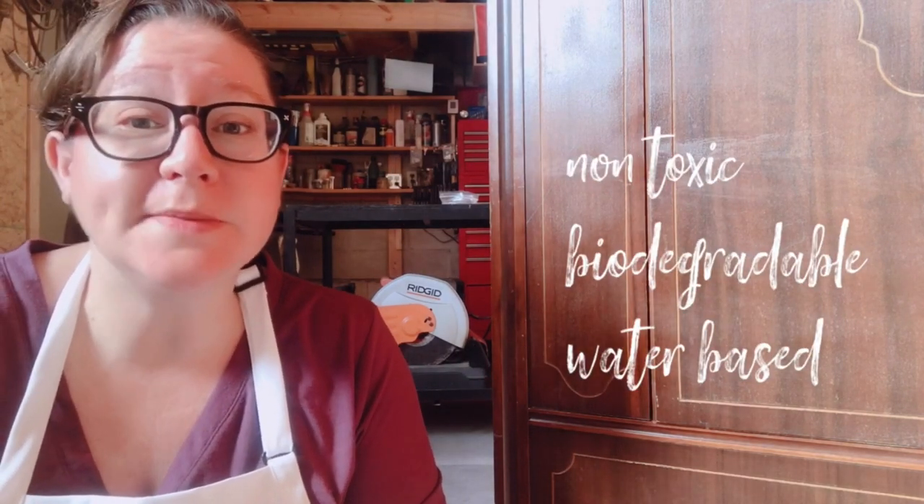To achieve this look, paint is important. On this project I'm going to be using milk paint. Milk paint is a non-toxic, biodegradable, water-based paint that has been used for thousands of years. A true milk paint will always come to you in a powdered form — it's a mix of powdered milk protein, lime, and pigments. Milk paint tends to naturally crackle, chip, and flake, so it's a great way to achieve an authentic-looking old paint finish.